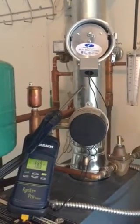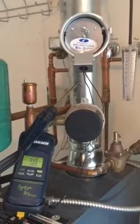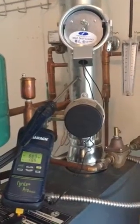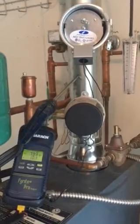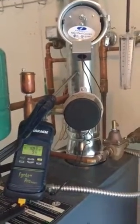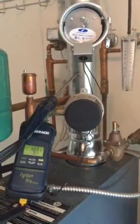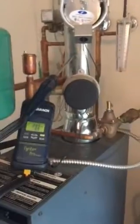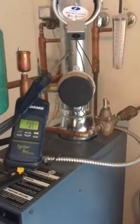We're at really poor draft here. As you can see the numbers are going pretty high, but that's common, especially when first fired up on a cold boiler. It doesn't ignite all the fuel — carbon monoxide is just unburned fuel. So you get high numbers and it drops back down.